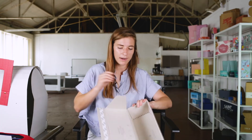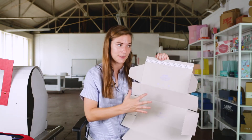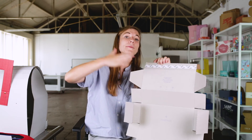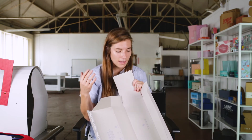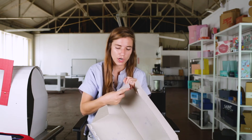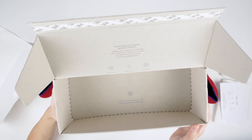Let's look at the construction of this box. When you see this box flat, you can tell the production steps that were gone through to produce it. First, it's cut out. Then it's foil stamped. And then this other production step of actually adding the glue tab usually requires a separate machine entirely. So you're adding production costs with each of those steps, but they're choosing to do it because of customer convenience. It's such a seamless end-to-end experience. They're kind of using the pressure of the tips of these zigzags to hold the box in place once it's put together. The zigzags apply pressure to the bottom of the box and bend a little bit, being slightly longer than necessary, and that really holds the box together.